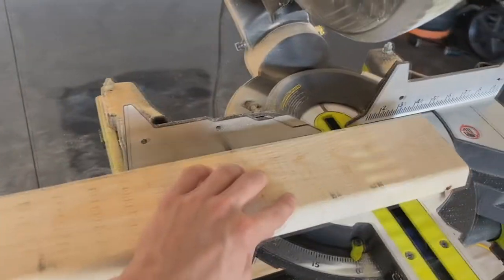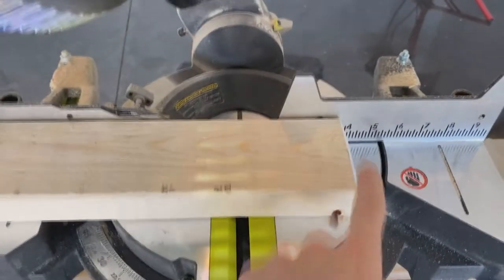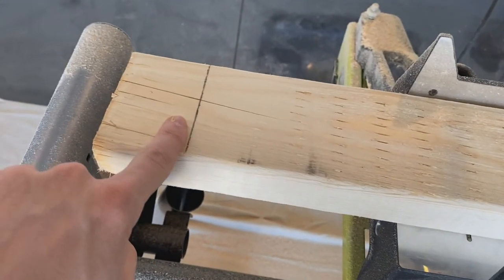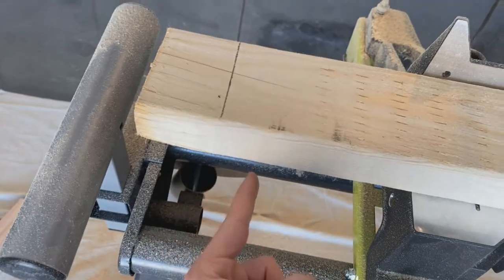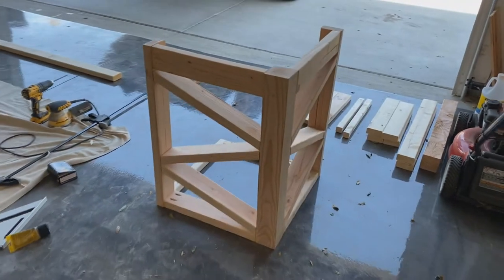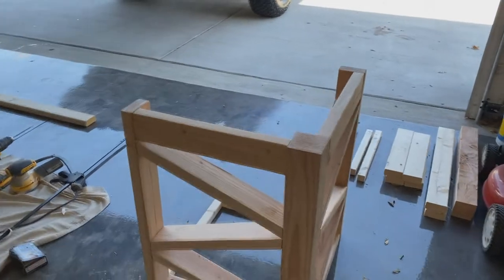Anyways, you just slide your piece over, and since mine's 18 on the width, we're going to cut a 19-inch board. So we make our first cut. We go from the top of this cut 19 inches over, draw a line, and then cut diagonally right there. Since we're taking a half inch off of each side, that 19 becomes 18, and we can line it up and stack it like that. Now those are just gonna be held in by wood glue, nothing more. So I'll go ahead and do the rest.